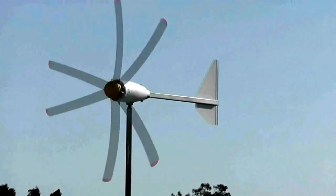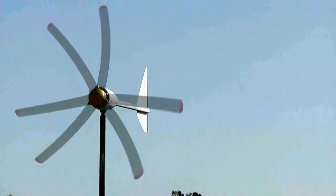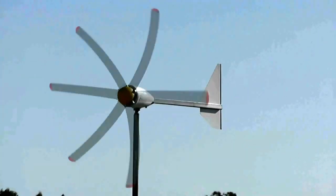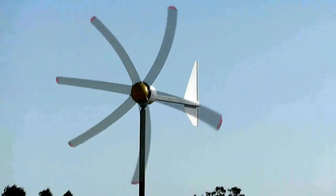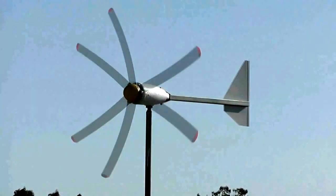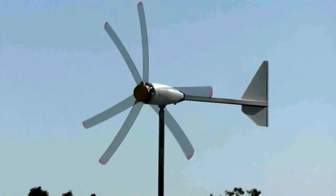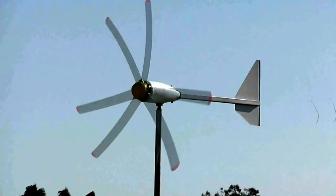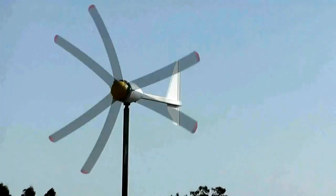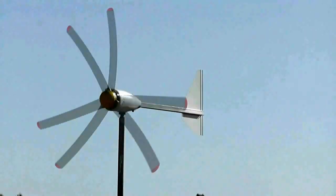As you can see it is swinging around quite a bit — gusty westerlies today, tending towards the south-west, and unfortunately the house and the water tanks are in the way. There she is in full flight — that's pushing out twenty-odd amps, twenty-two amps today. Wind gusts up around twelve metres per second and the highest wind so far this morning has been a constant 8.2 metres per second. So it's doing quite well.